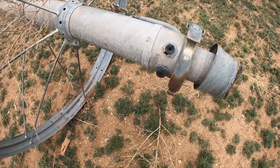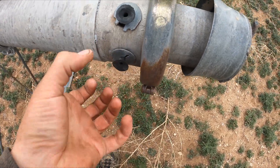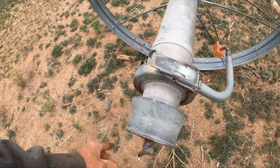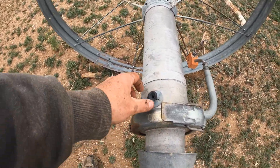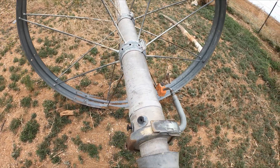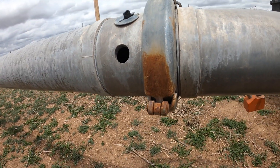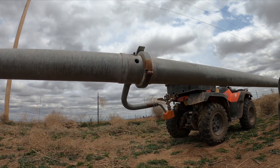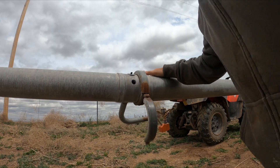What we got to do on these mushroom drains: we basically pull this and then we just move that metal tab up so it's really tight up against it, because they wear out throughout the end of the year. The other thing we need to do is turn this and open it up so we can let whatever junk's in there wash out. So we're just going to go down the line and tighten it up. We got all the mushrooms tightened back up — there's only a handful that needed a little help. Here are the culprits — they just broke off. That one's got a double clamp on it, so we got to break this connection and then put the new ones in. These things can be a real pain sometimes, especially in the wind.